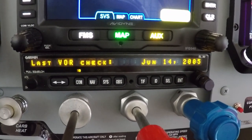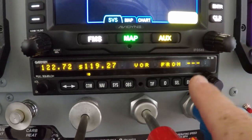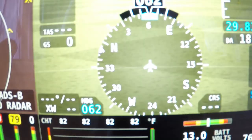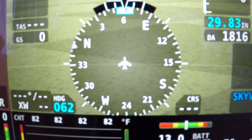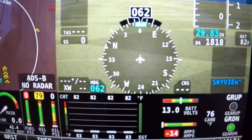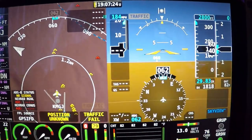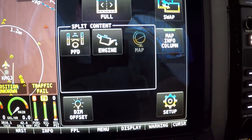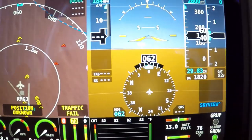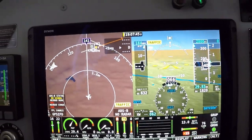I kept the SL30 — it was a great unit, hardly used by the previous owner. I used the Garmin GNC 480 before. I kept it because I wanted the nav and com features, which also flip over to an HSI. So I can track a VOR, track GPS — one course line is magenta, one is tan. I'm still getting used to all this. It's getting traffic right now with synthetic vision — really neat. And it's calling out traffic while I'm in the hangar. That's how great this system is.